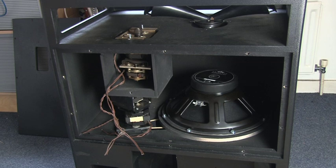I'd now like to mention one or two things about treble drivers. Over the years I've done much experimenting with Leslie speakers and from a tonal point of view I've always found the Jensen V21 drivers — the original ones — to be the best sounding. But they are a little on the fragile side if you abuse them. The diaphragms can go off centre and they make a horrible buzzing noise, or they can blow altogether.